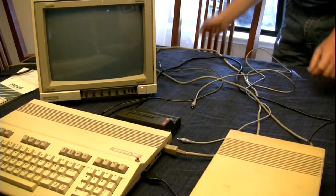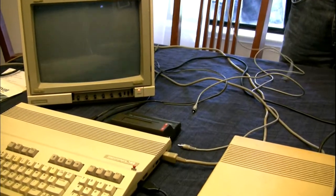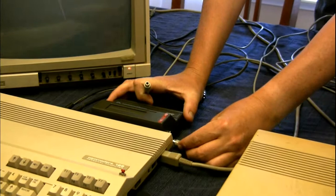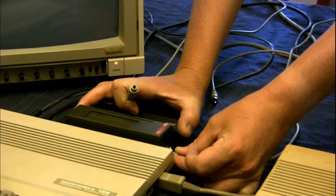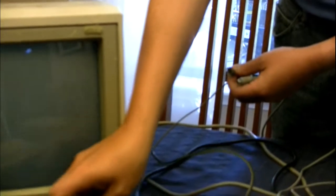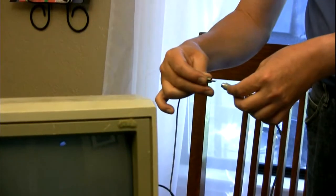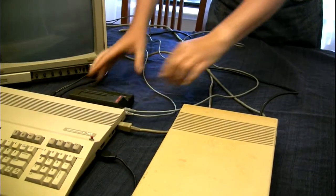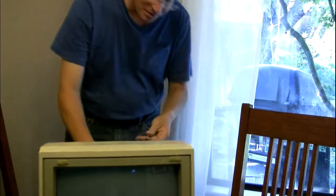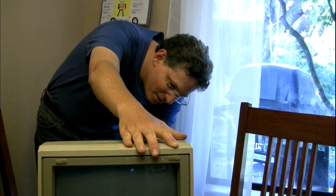We'll hook it up the better way, not needing that cable at all. Take the cable that has the female RCA jack and hook it into the audio input. On your monitor cable, take the audio output from the computer and plug it into the female end of that jack — it is now being input to the speech module. Then plug the other end into the audio out jack. Mine has been labeled here. This goes into the TV speakers, the monitor speaker, or your audio amplifier.